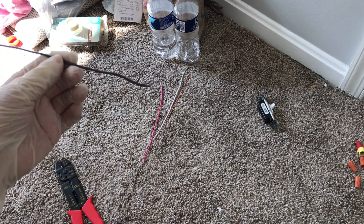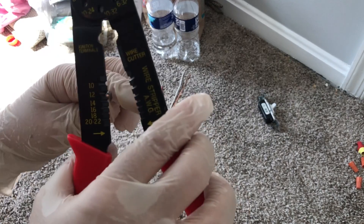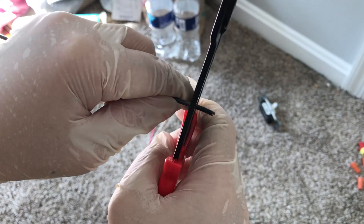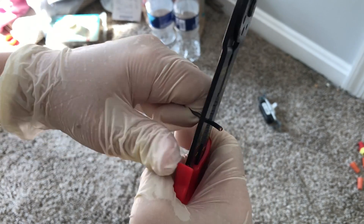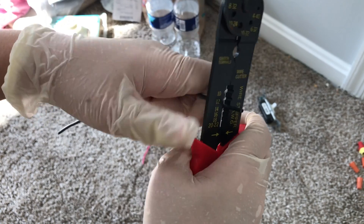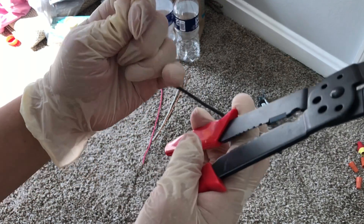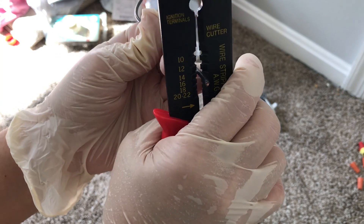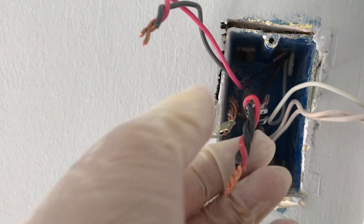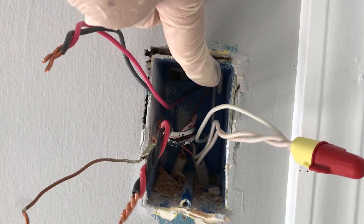Because I've got so many wires, I'm going to create electrical pigtails using 14-gauge copper wires. Here I'm just showing you how to strip the wires using a wire stripper. Because I don't do much wiring, I have a cheap five-dollar one, but I wouldn't recommend this at all. I'm going to create one pigtail by connecting one wire to all the red and black wires in the box other than the two wires at the top that are wired to the ceiling fan, and I'm going to create another pigtail for those.